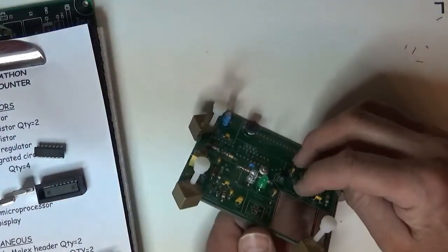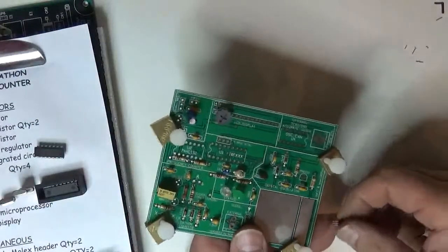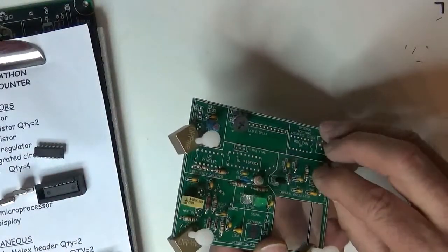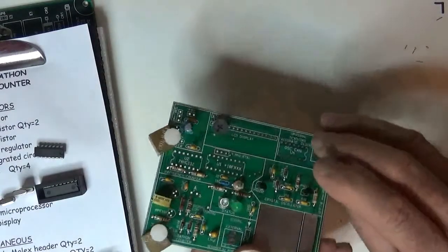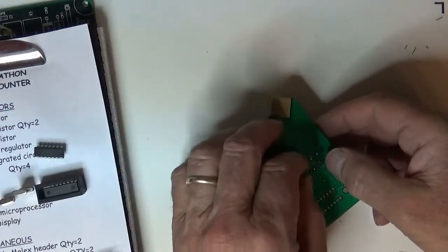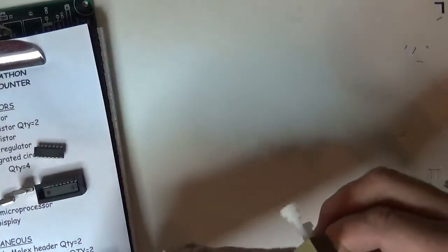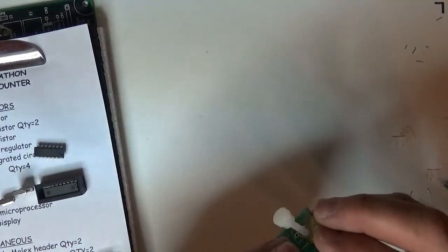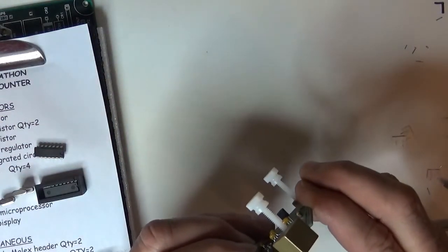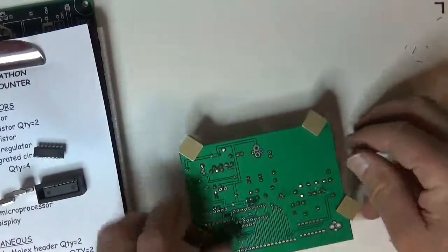Plus again, having that extra lead length helps dissipate the temperature from the soldering iron, protecting your transistor. If you have the thing buried right down to the board, you've got no distance at all between the iron and the actual semiconductor, so it's going to get hot inside that case. So I'm holding it about where I want it off the board, spreading the leads just a little bit. So those are still up about, maybe, a quarter of an inch.